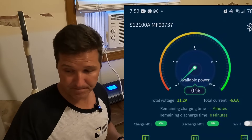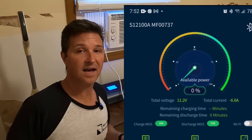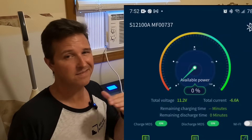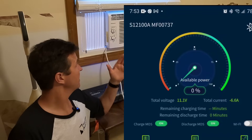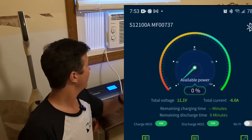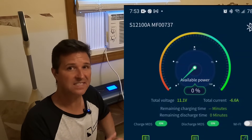As you can see on the app, our battery is down to 11.2 volts, so I have a feeling once it kicks on again it'll probably cut off. The state of charge has read zero for the past ten minutes, so that part was a little off, but it's just a reference anyway. With this 5,000 BTU air conditioner in a 110 square foot room on high cool at setting five, it did maintain the temperature in this room at between 73.5 and 74 degrees.